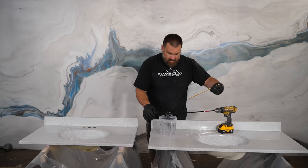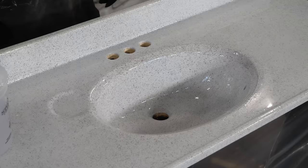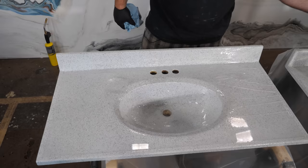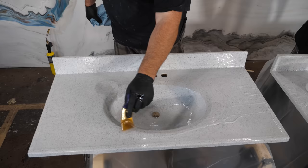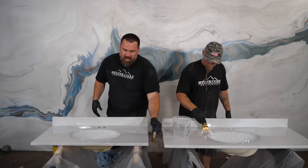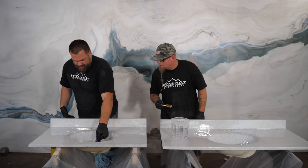Scrape your stick — now we're good to go. Mix one more time for another 30 to 40 seconds. I'm going to dunk my brush and start painting the sink bowl and backsplash. You don't want to get it too thick where it starts running. It's okay if it runs — we have plastic down. Give it a good coating, knowing that yes, it is going to self-level down. That is why we're doing the second coat, because your vertical surfaces are your thinnest part of epoxy.